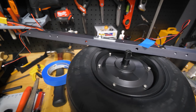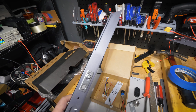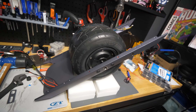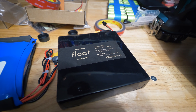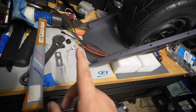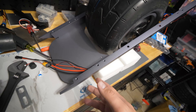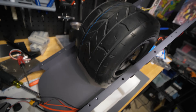As far as the inside of the rails, I basically knocked down all the sharps I could on the inside of both rails — it's just a matter of sticking something down the rail that can flatten out and take away the sharp edges and protruding bits. I did a bit of custom wiring because I'm building my own pack for this, which probably wouldn't apply to you if you got the entire kit. The point of this clip is to make sure you know that the back plate, the bottom one, is a little bit hard to convince into the slot in the rails.